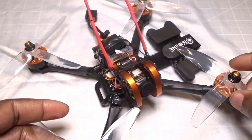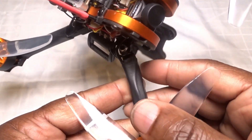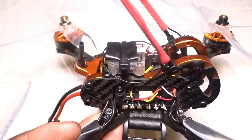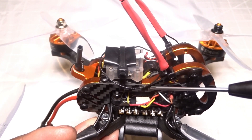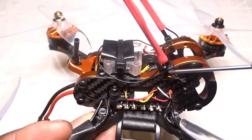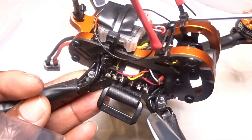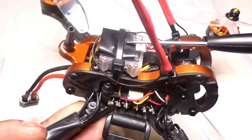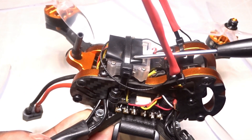I am done and everything is put together. It's not an ugly looking drone. I did make a couple changes. I added a DVR and it is powered by the VTX - the VTX does have a 5-volt output. And I also added my FrSky receiver, which is a RX4R. I had it for a little while and just took the pin out.